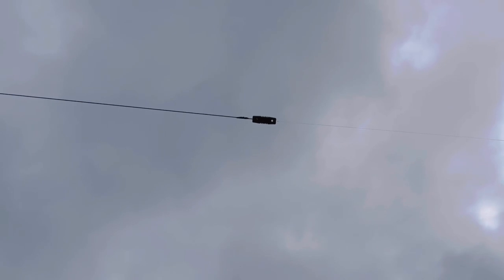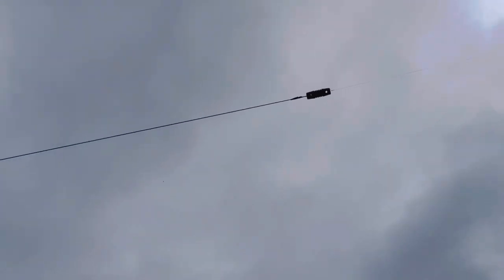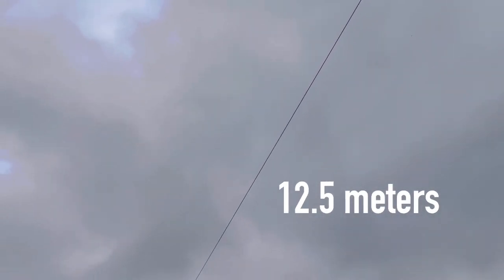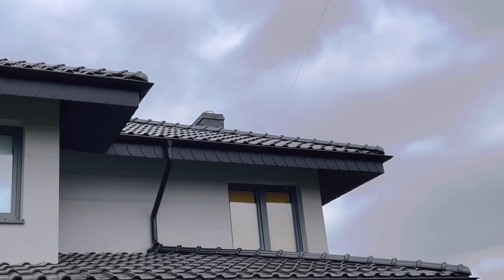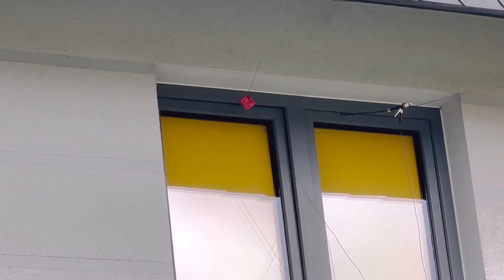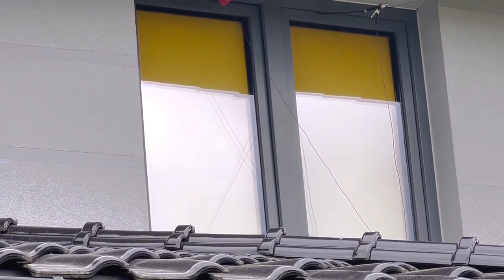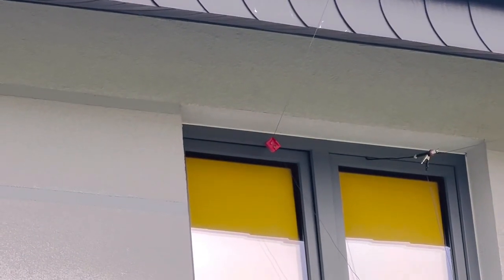I want to experiment with how this 41-foot antenna, which is obviously pretty popular, works for me. Here's the setup and here's the antenna — there's an insulator, and a monofilament fishing line going down the top of that fence and back up to the antenna. That's 41 feet of 22-gauge wire, going up to the window. Up at the window, if you zoom in, is a 9-to-1 un-un. The coax goes on the outside through the window, with a 17-foot counterpoise coming down over to the top of the roof. There it is — my 41-foot end-fed antenna.